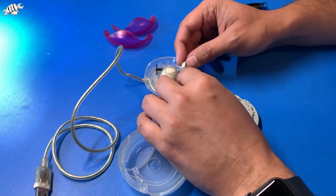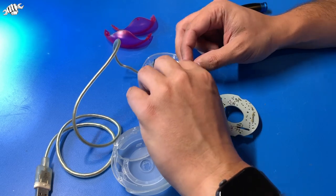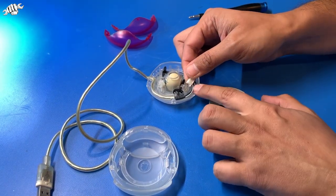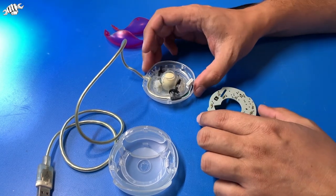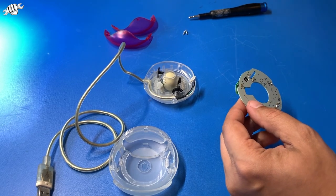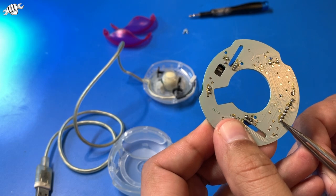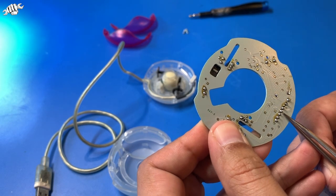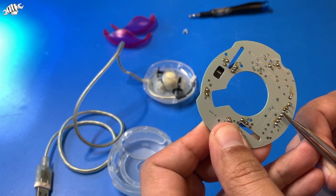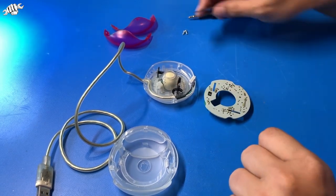And the pinout on every mouse I've opened, come on, get in there, it's the same. All these wires, they're always in the same place. So what we want to do, let me get some tweezers here, is attach an LED. Positive goes to this first lead, negative goes to lead number 4, right here. So that's all there is to it.